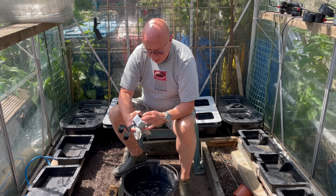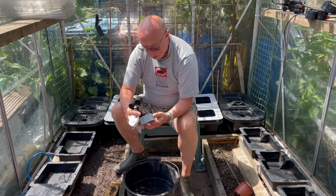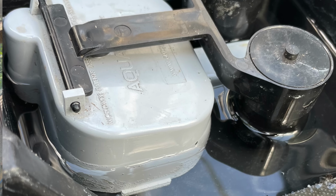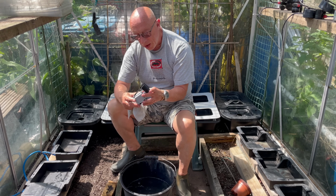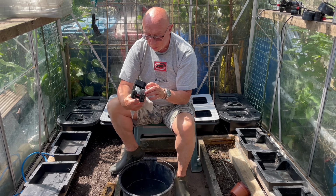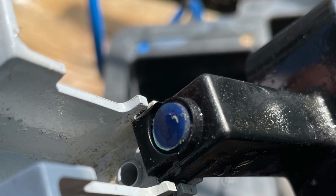We're on the home straight now, just tidying up the AUTOPOTs. This is the AQUAVALVE, which is the heart of the system really, and this is one of the version 5, the latest one. It's got a bigger bore and it gives better flow rate and other things, but this works on what they call a flood and drain system. There's 2 floats in here, and be careful if you've got one of these, just check the rubber. There's 2 little rubber bungs on there, and they must be clean, otherwise the valve won't work.